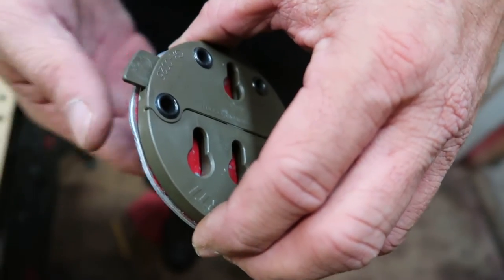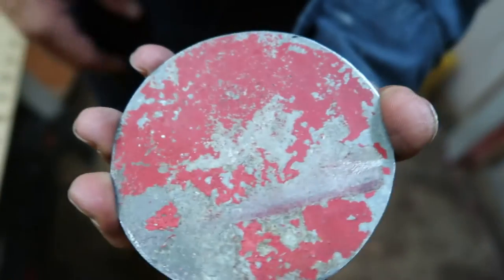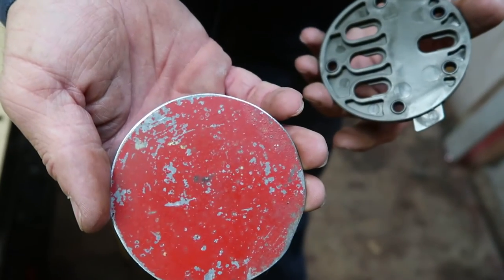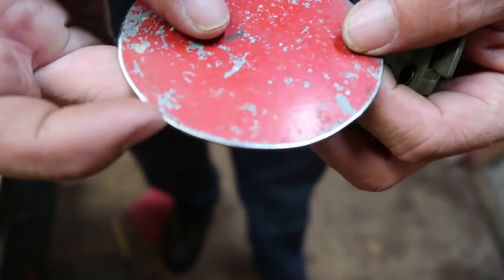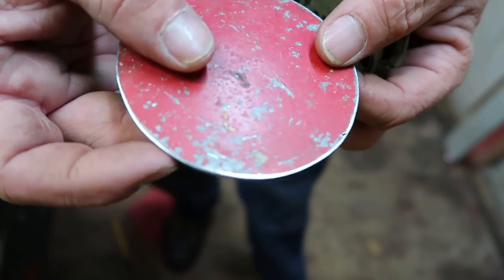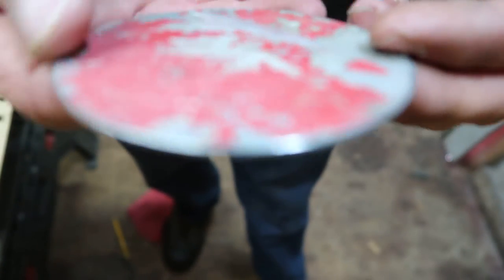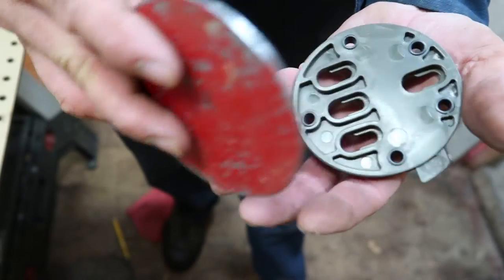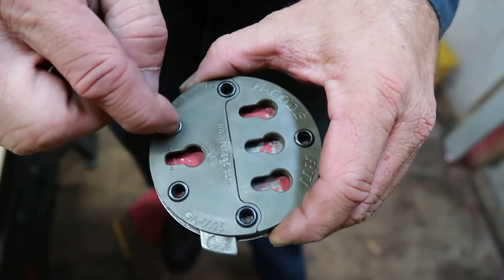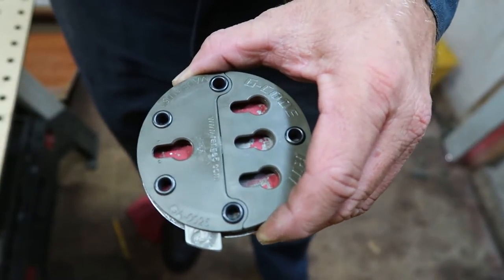There's pretty much the finished product. It's got a little flat spot there — turn it and hide it right behind that, no big deal. It's a touch bigger, which is absolutely perfectly fine. It will be getting a paint job. That came from a rectangular piece of steel using a hacksaw and a couple of files. I'll lay this on top, get it pretty centered up, take my pencil, draw my spots for my holes, take it to the drill press, and drill each one out after I figure out what size the screw is.